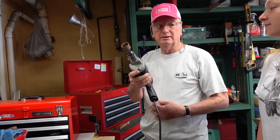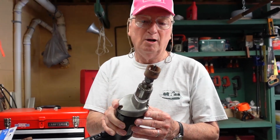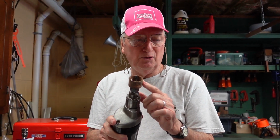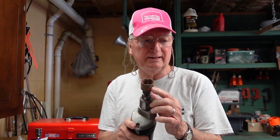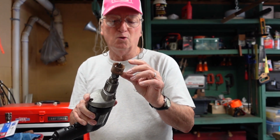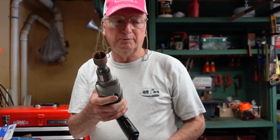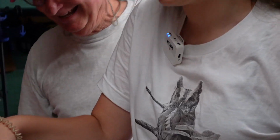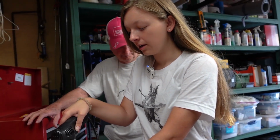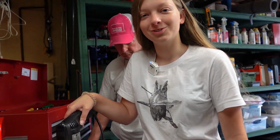This is a regular hole drill that you buy in sizes. If you don't have something like this, you can use a regular paddle wood bit. You can buy those in different sizes, like at Lowe's. This one is a 1 1/4 size, and that's what we're going to use to drill the hole. We lined it up and already have it marked. We marked the top of the hole 1 inch down from the top of the board. So we'll go ahead and drill it out.